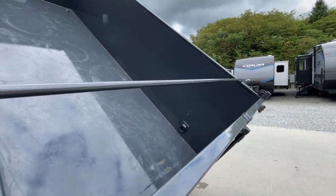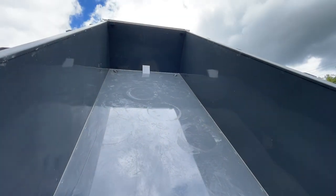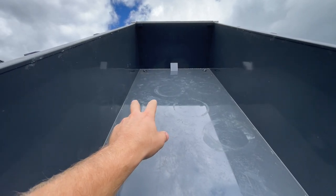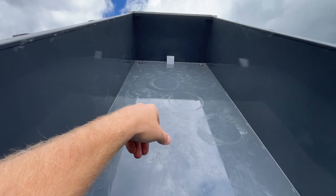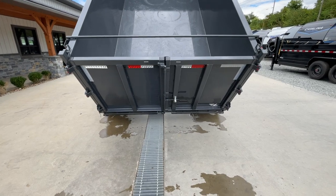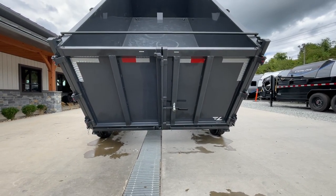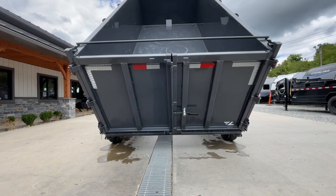There's actually a retainer at the back on these high-side 16s. You're going to get that little cutout up front, just like your semi-rigs and dump trucks. D-rings in the corners — you've got four rings, and these are 4-inch rings, not 3-inch. At the rear they're reinforced at the bottom. On this high side, notice there's an extra hinge on the rear door, and the door is the same size as the sides, so you've got 4-foot all the way around.